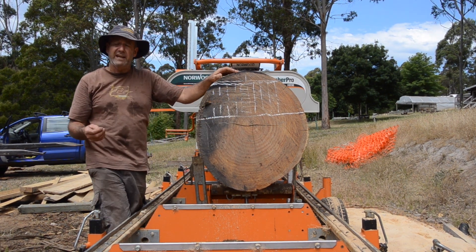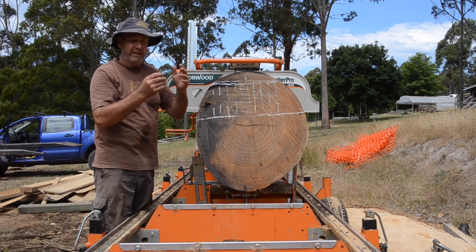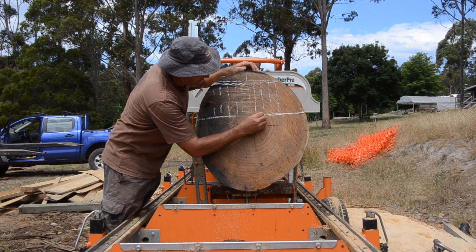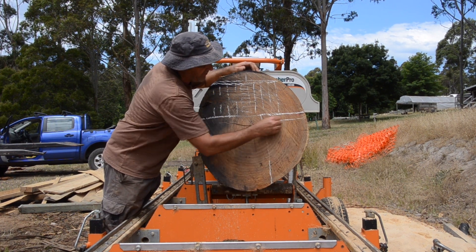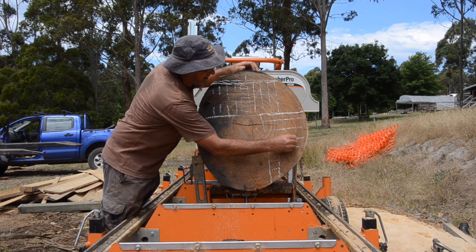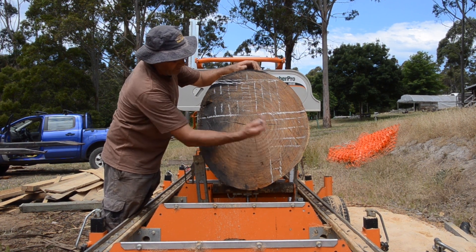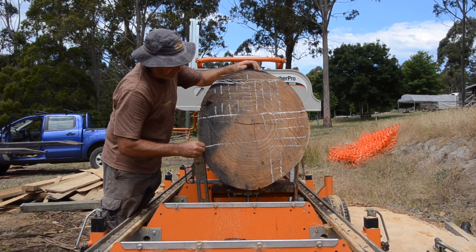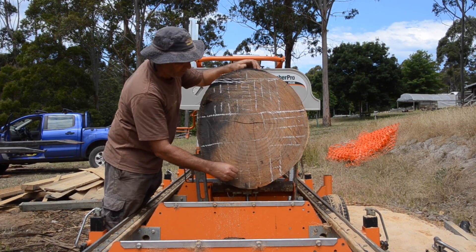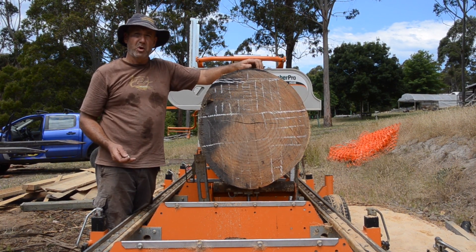There'll be some need for straightening cuts to manage the movement. That top section will go and then come back. The next cut will come through here and that piece will go off — I can cut quarter-sawn boards, maybe even change the angles on milling to cut that section later into quarter-sawn boards. Then, when that's back off the mill, I'll cut across here, do the same when I bring that back to get quarter-sawn boards, and with one more cut I've boxed out that central core.